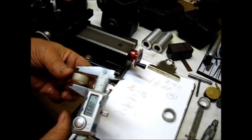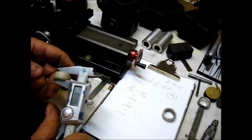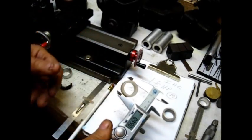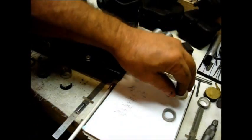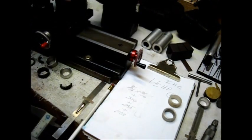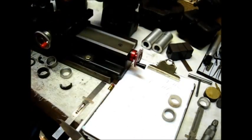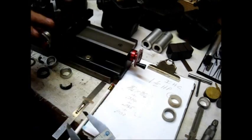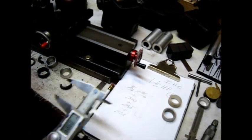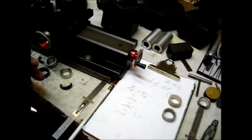The one that I did order is 406, which is in the ballpark. It's 1 inch on the outside diameter, but you make it a couple thousandths smaller because that's the size of the hole in yonder. If you make it a couple thousandths smaller it will fit in there, taking rust into consideration.